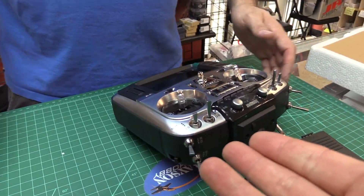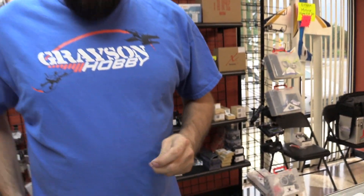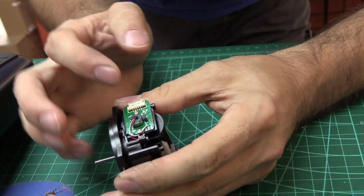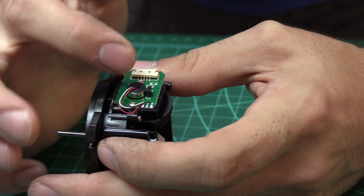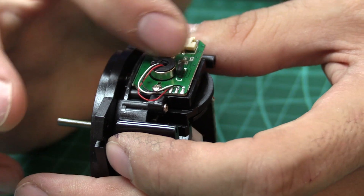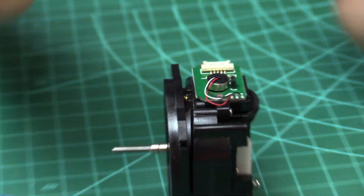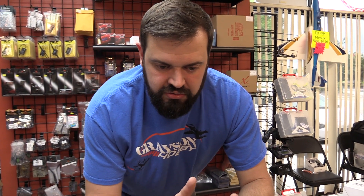So what's the big deal about these Hall Effect gimbals? The Hall Effect gimbals use magnetic sensors — essentially a magnet on the side of the gimbal that detects the variation of north and south polarity. The nice thing about that is there's no metal-to-metal contact to wear out. A normal gimbal has a potentiometer, which is metal sliding against metal of various resistance — that's how it figures out position, and it can get oxidation and wear out.